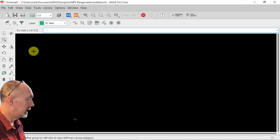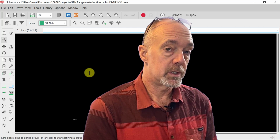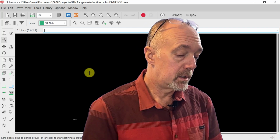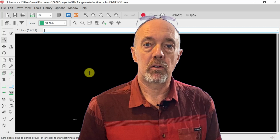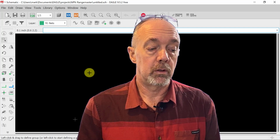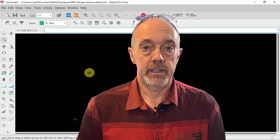All right. First thing we're going to do is modify the circuit so that it uses an NPN transistor instead of the PNP of the original. What that's going to do is allow us to have a little bit easier time using power supplies with other pedals. If you plugged in a center negative power supply to the circuit the wrong way, it's just going to short out. You're going to have the case be the positive instead of the ground.